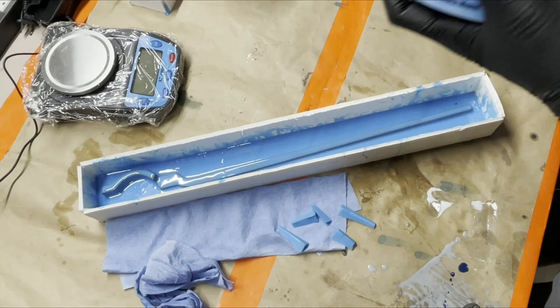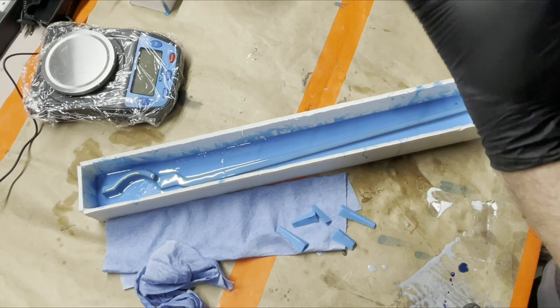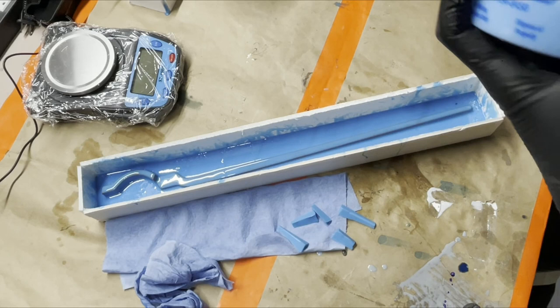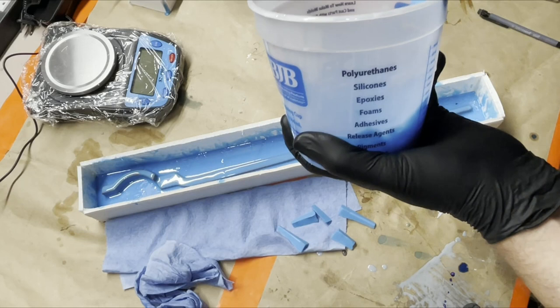And because I don't know that we're going to be making a ton of these, I also don't want to spend a ton of money on the mold if we're only going to make a handful of these. I don't know. Maybe people would really want these. That would be cool. We're going to cast them in resin and with fiberglass rods down these to give them a little bit of extra support and rigidity so they won't snap or anything since they are long and skinny. So you can see, maybe, let me do a quick scrape here.